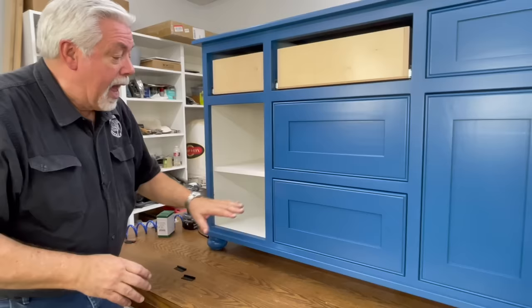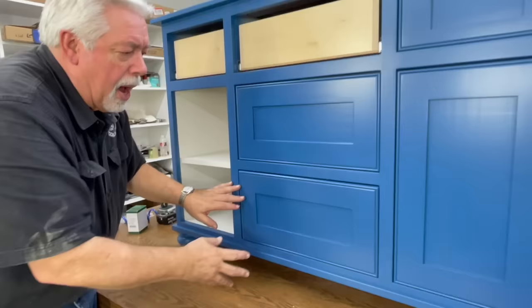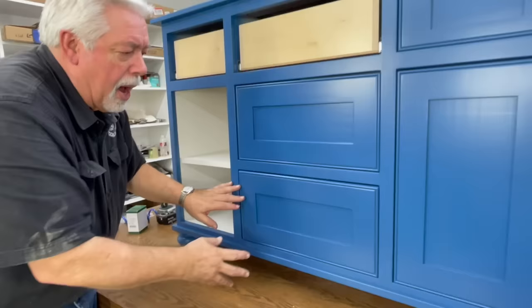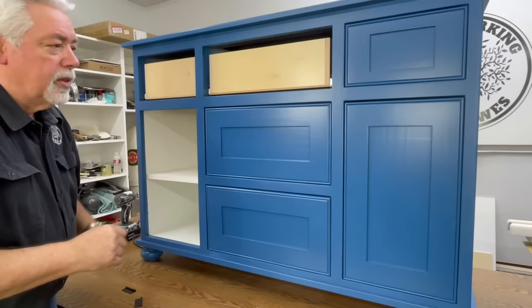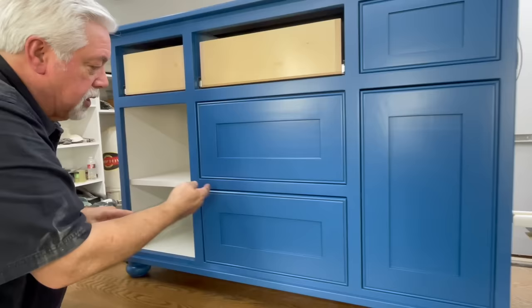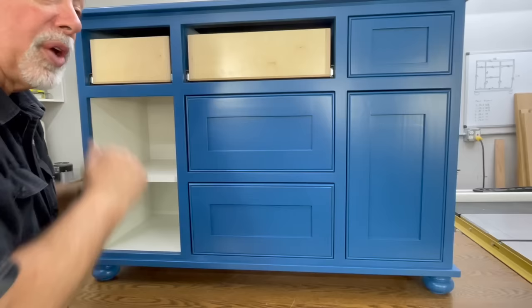We have our cabinet together. I went ahead and put all my drawers in and set the drawer faces and doors in so you can see how it's going to go. These are going to be inset doors and drawer faces. For the doors, I'm going to use a no-mortise hinge that will be on the outside. The drawer faces will be attached to the drawers and then we have some nice hardware that goes on. This is a time-consuming process to make sure all of the spacing is exactly even around — the inset has got to be exactly right. I'm not going to make you watch me do that but I want you to see when it's all done because it's way cool.